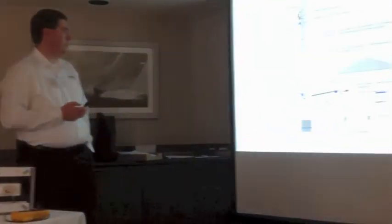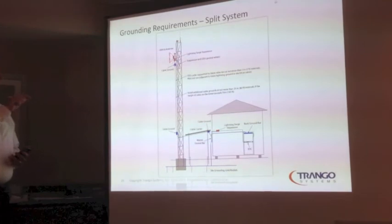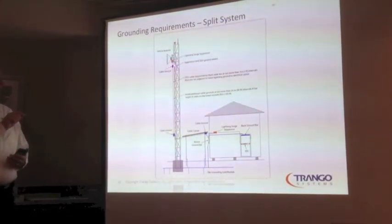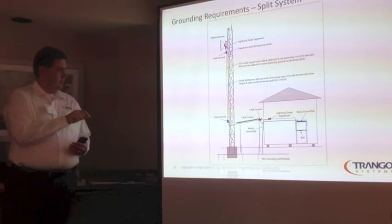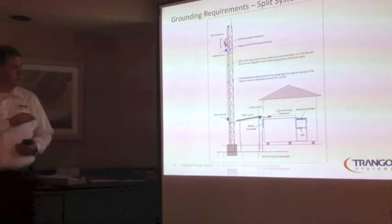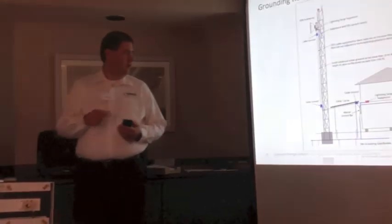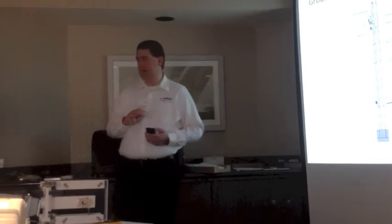Here's a picture of what we just talked about. Right up here is your outdoor antenna and then your ODU. The red thing right here is your lightning surge suppressor — that's going to come right off and get grounded through your tower. As soon as the cable hits the tower, we're going to ground it again. Ideally we're grounding it at the bottom, and as we come in, there's your master ground bar, your lightning surge suppressor, and then your IDUs. If your tower height exceeds 165 feet, you'd want to install additional grounds every 80 feet or so.